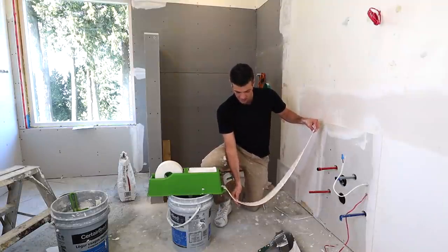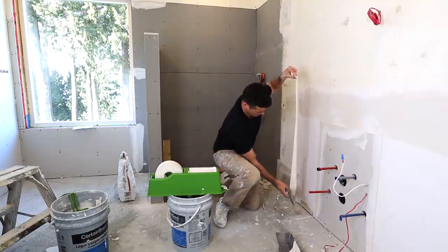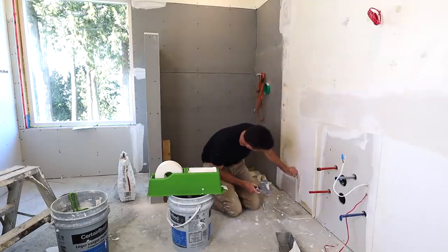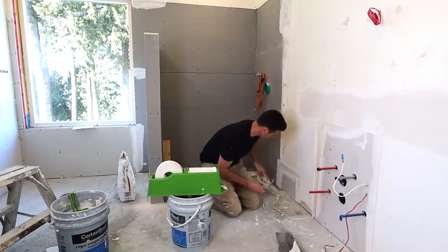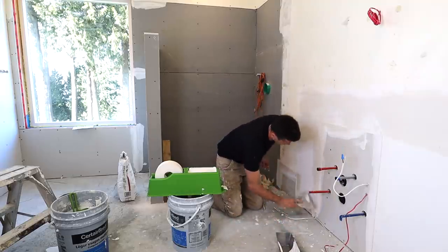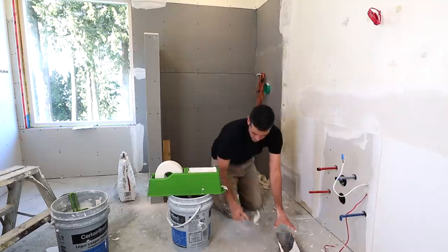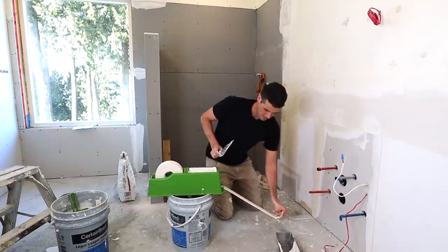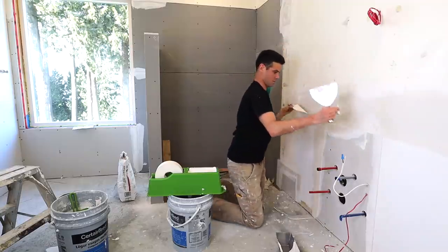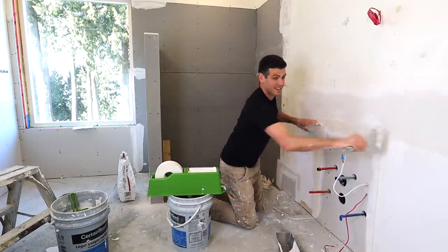So let's estimate that length there — right about there. Tear that off. I've got a little extra here, I'm going to cut that off and put it on this joint. Too short — don't need that piece. Just wipe the mud out, super easy. Get another one done here and pull down like so. Extra tape — take it off, put it in a bucket, or in my case on the floor.